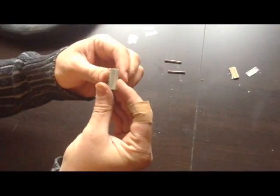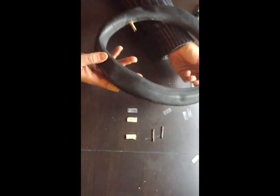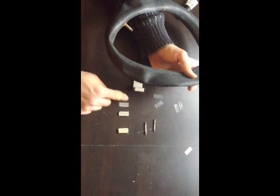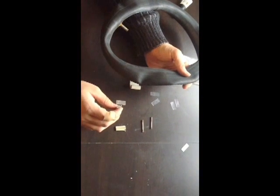If this rubber piece is thoroughly destroyed, and in this case it's worn, but it's serviceable, then you can use the existing rubber. If you need to replace the rubber piece, then you need to find rubber. What I use is an old inner tube, and what you can do is cut out two rectangles of the shape and size of the metal plate and glue them together to get a decent thickness, and then use them in the process I'm going to describe now.